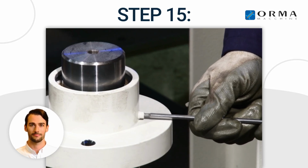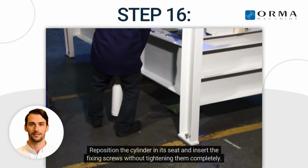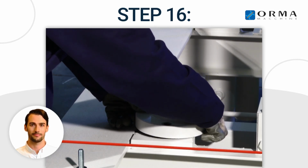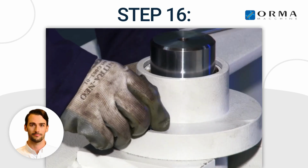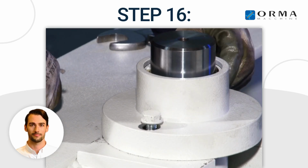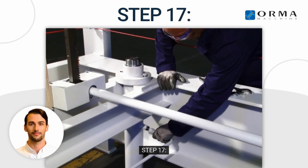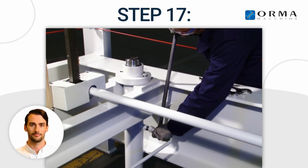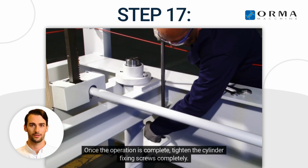Step 16. Reposition the cylinder in its seat and insert the fixing screws without tightening them completely. Step 17. Reconnect the supply pipe and tighten the fittings. Once the operation is complete, tighten the cylinder fixing screws completely.